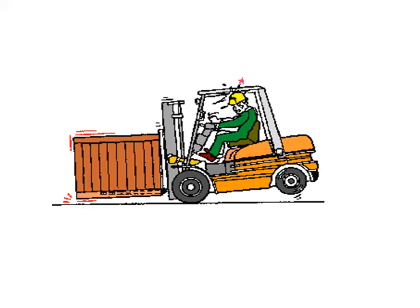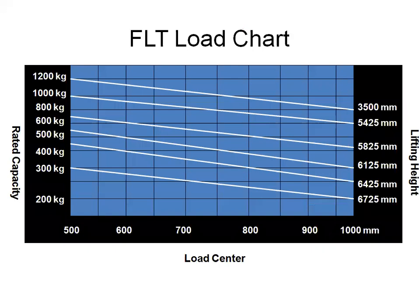Braking, cornering, lifting, tilting and lowering loads, and others are important stability considerations. When determining whether a load can be safely handled, the operator should exercise extra caution when handling loads that are close to the truck's stated capacity. You can check the truck's load chart to confirm specifications such as load capacity, load center, and maximum height the truck can operate. In doing so, you ensure that you aren't over the specified capacities of the truck.